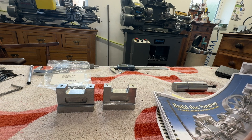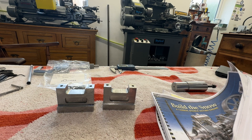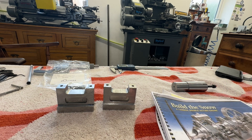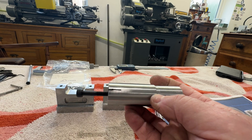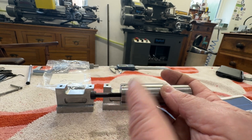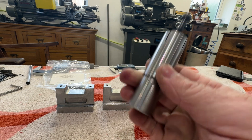There are eight fixtures in total, which includes a tube bender, so there are quite a lot of side projects for this. I've already made one of them - these are for the cylinders to be held in an expanding mandrel, and then this is to face the ends absolutely square. So it's going to be a bit of fun doing the fixtures as well as the engine.